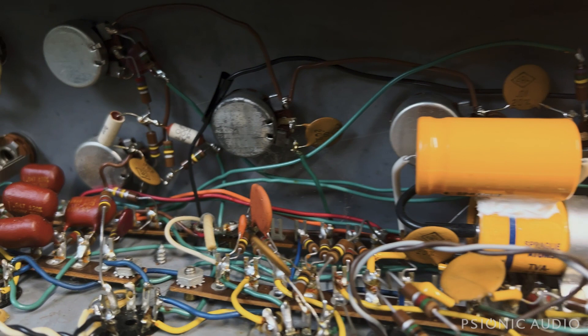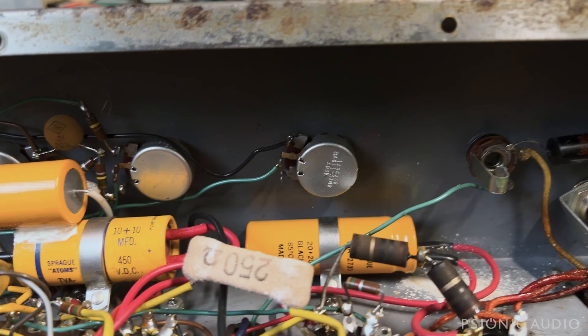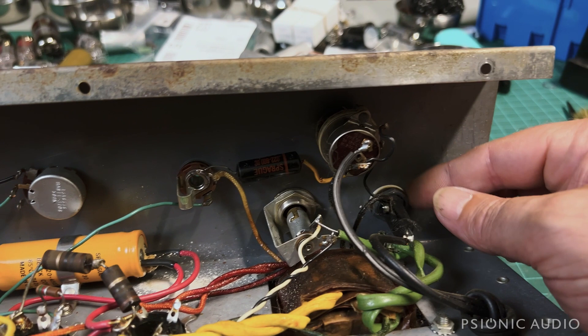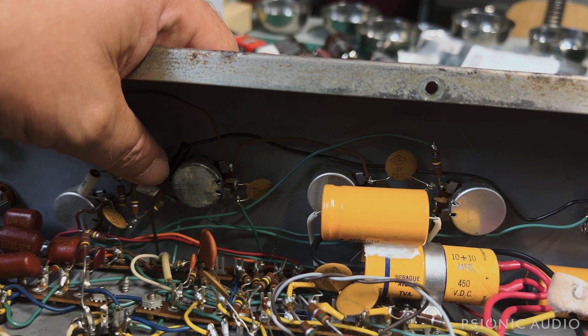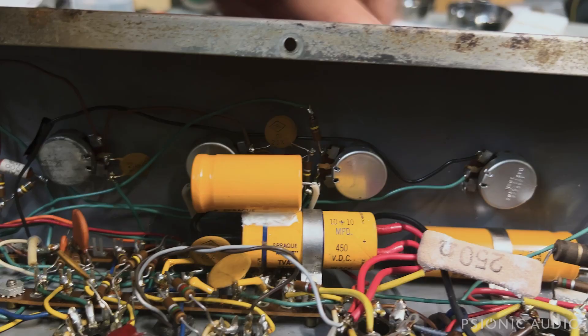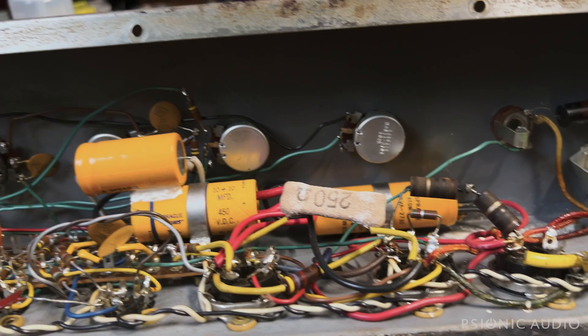So I will make a note of the cap values needed and some resistors that can be prettier than this, and talk to the owner. It needs a grounded power cable, and the fuse holder is at least loose if not defective. I'll see if there's any damage to these pot bushings where they've been loose for who knows how many years — because once those pots are loose and you turn them from the other side, the entire pot wants to turn, and that can stress out anything soldered to them.